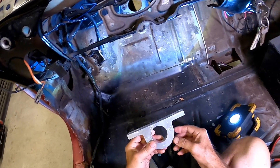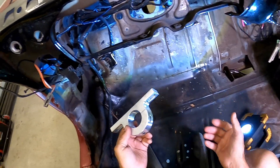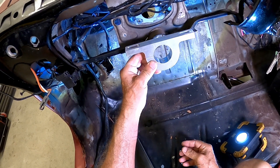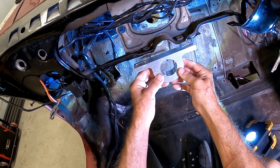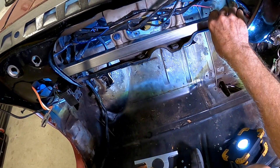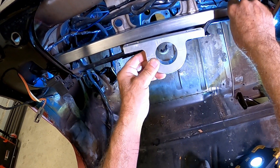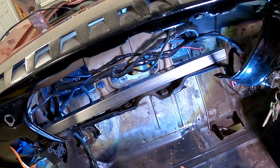One thing is in front of the other and I need to get the steering column in to figure out how the gas tank is going to be made to go around the steering column and its plumbing. I'm using this pillow block mount, but it can't go down here — it's too low. So I'm going to graft in 1/16th inch one-by-one, cut it back, and mount this to that and tie all these things together. It seems to be the easiest and hopefully the strongest approach.